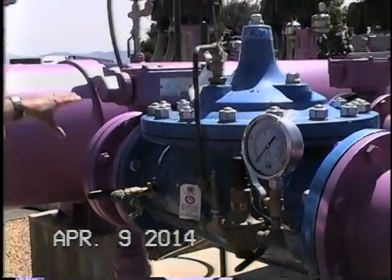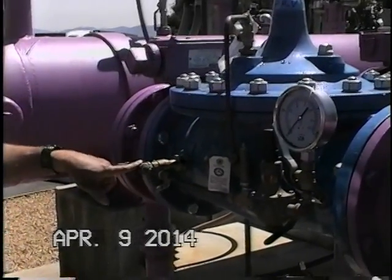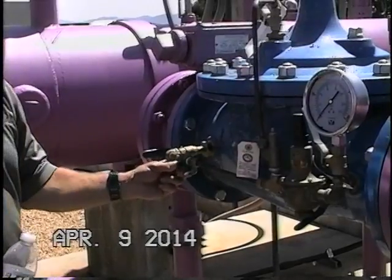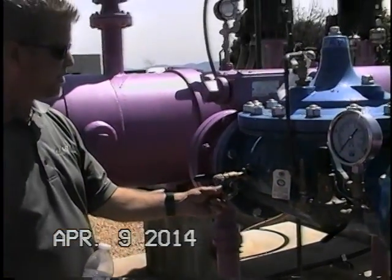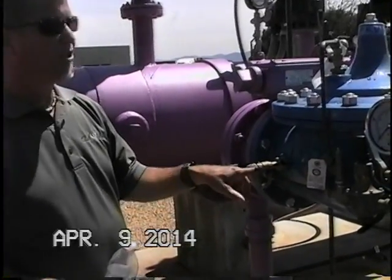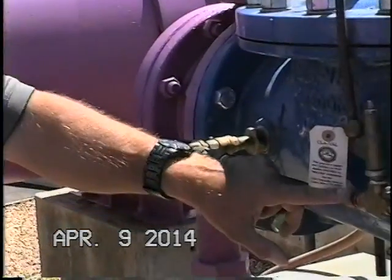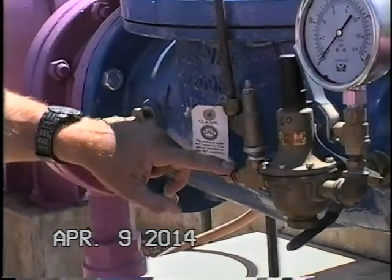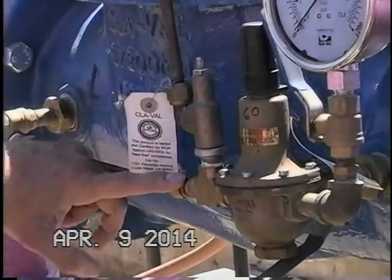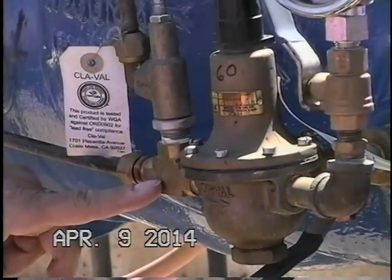Basically we take high pressure from the upstream side, take it through our upstream body port through our Y strainer. This is a maintenance point. This should be checked and serviced a couple times a year. Strainer? The strainer, correct. And then to our fixed orifice restriction, we call this an X58. Again, this has the 1/8 inch orifice inside. And our cover connection, which is basically our female T right here.